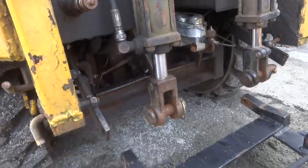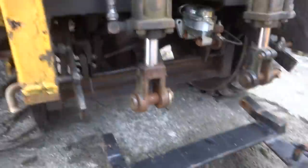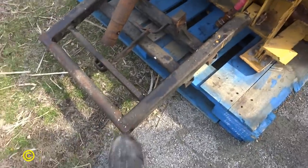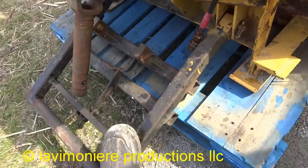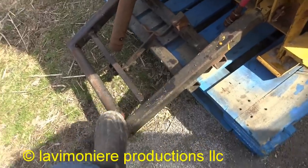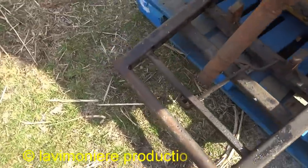These will come down. I'm not too worried about that, but we'll fab something up. I got something to go by right here, so I gotta make a frame like this. That looks like 1.5-inch by 3/8, or 1.5-inch by 3/16 probably. I'll measure it.